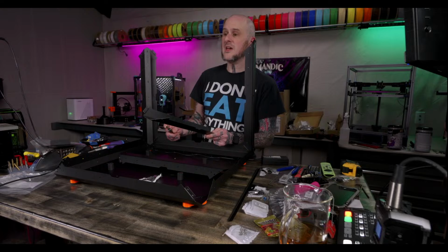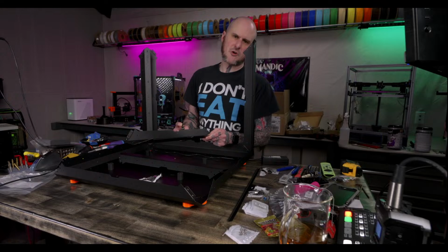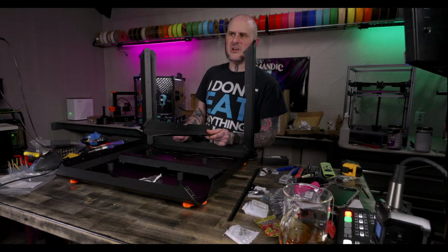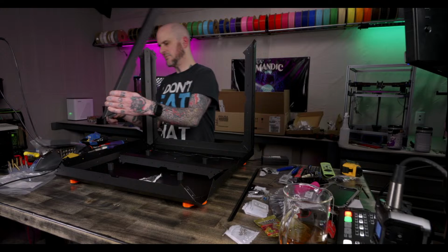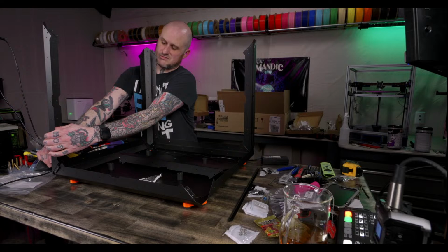The Mk4 immediately felt like a different experience. First layers drove me nuts on the Mk3. I could never get a good first layer. Like, I could, but then the next print, it felt like it would be wrong. And then there's Z offset calibration adjustment. The first layer stuff on Prusas, the live Z adjust or whatever, was so annoying on the Mk3. The Mk4 just works. Every complaint I had about the Mk3, I don't have about the Mk4.